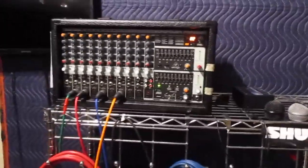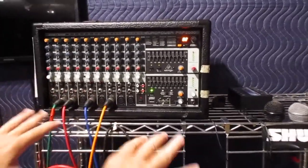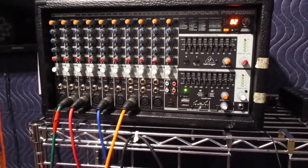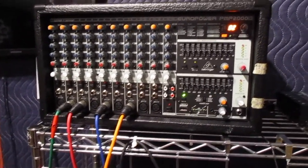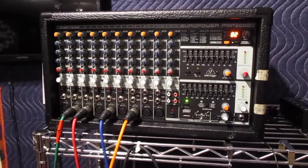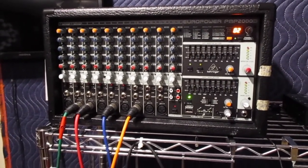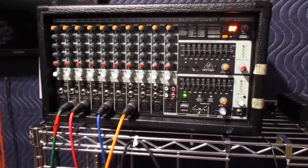And then this is the most important part, guys. Once I find my rings and I take them out, we're going to max level the whole PA system so there's literally no rings left. Then we're going to bring the volume down, say, by 3 or 6 dB, and you're ready to perform it. Maximum volume with no feedback. That's the goal we're after right now.